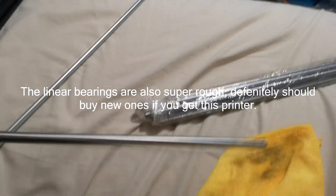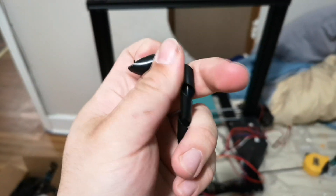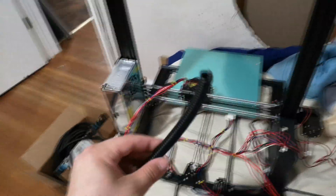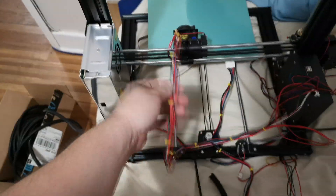I'll just add a couple notes as I see things. There's some sort of gunk on the actual guide rails - like a yellowy crusty buildup - so you'll want to clean your rails off with some rubbing alcohol before putting it together. They sent this weird winding pipe - I call it twisted looming - and I was worried I wouldn't have small enough split loom tubing. But actually based on how much this has to expand, the 3A split loom tubing will do nicely. It's a bit stiffer so it has more resistance, but I don't know if that'll matter much, and it's gonna make this thing look way nicer. I might still do the cable track things.